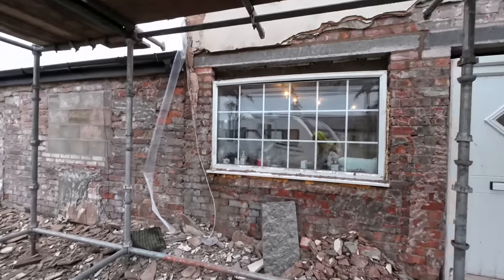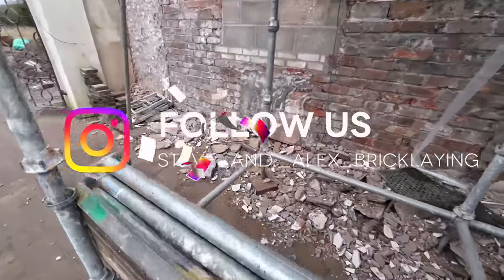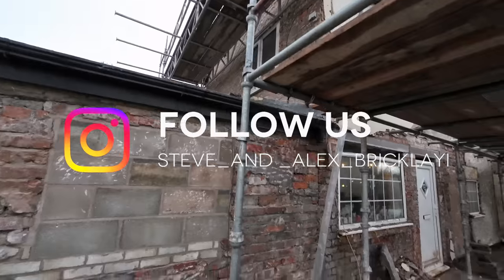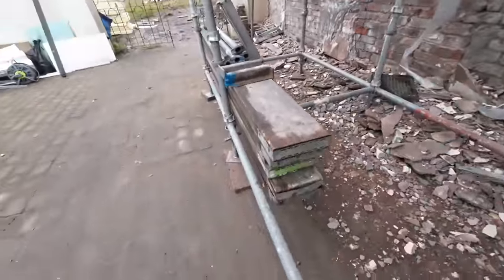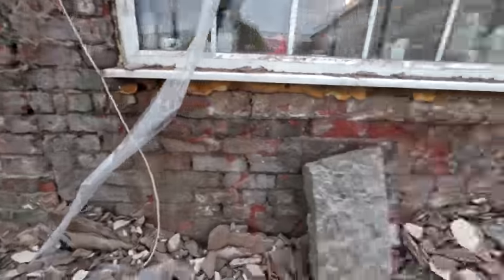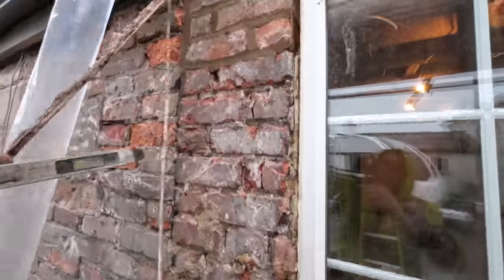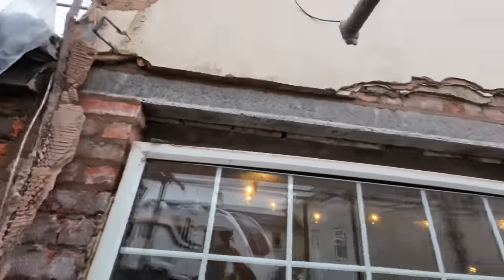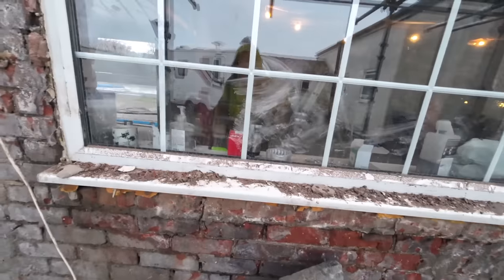And there we have it. It's a couple of hours later since I finished it, but these guys were approaching, so it was just too noisy. And they were above there, so a bit dangerous as well, so I had to get out of there. But yeah, all in. I've stripped this scaffold because it's not needed anymore. I'm finished with that. That's all stripped out of the way because that was on this level. So there we have it. All built up, that's been tied in with the bluebird tie into the existing. In nice and level, all top pointed solid under them headers.